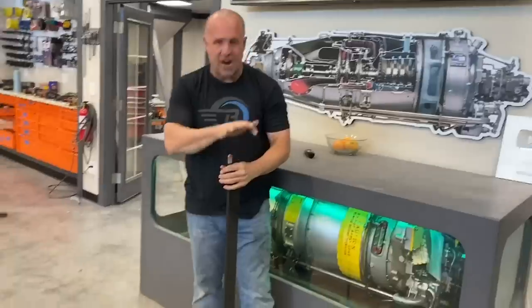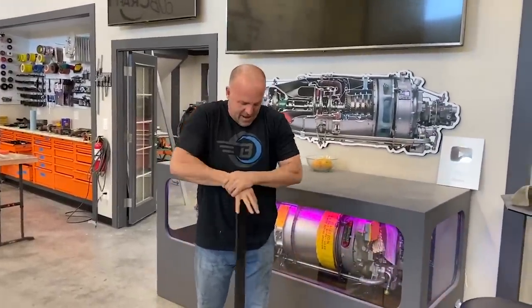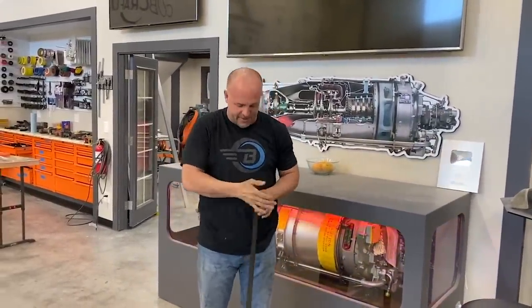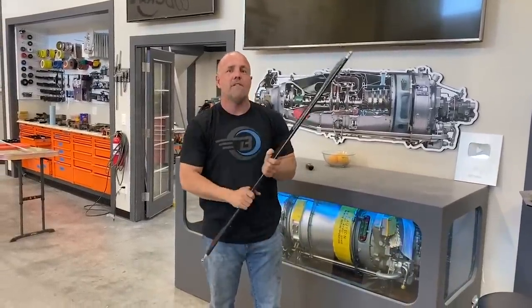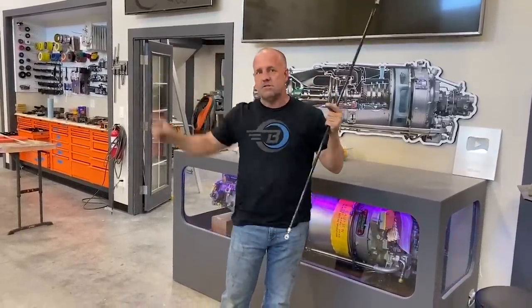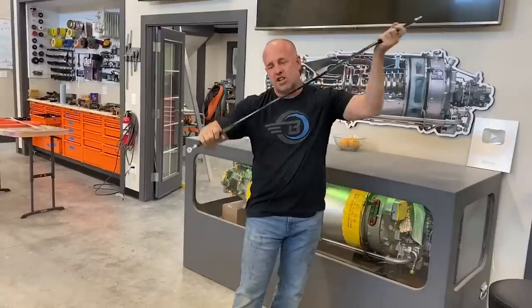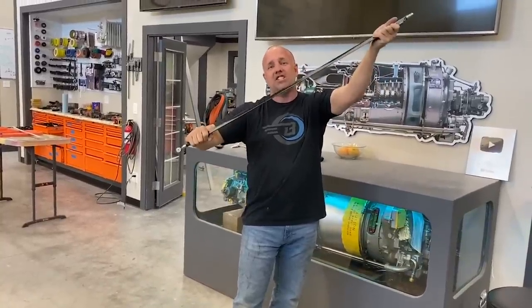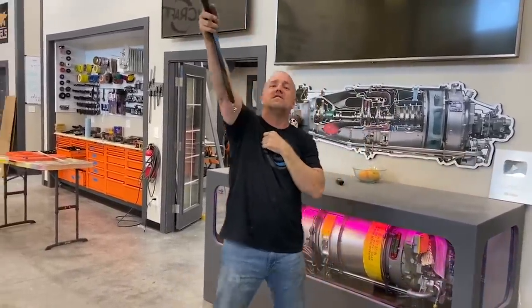The other thing that's kind of fun, a flying wire has no compression load. This, I could put over 500 pounds on this before it starts to bend sideways. So a flying wire would just bow out. A flying wire is all tension, so as you tighten them all up, they all pull against each other. I will do the same tension on these and make it all in tension, but also with that big old blast of this crazy prop up here.